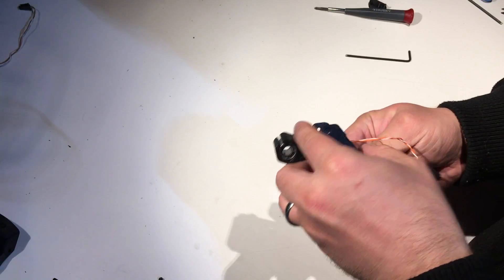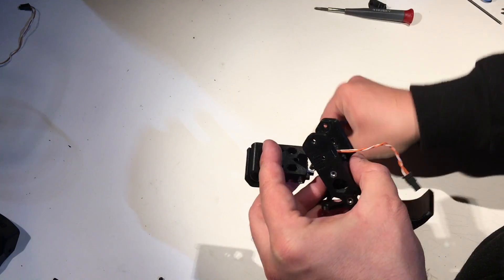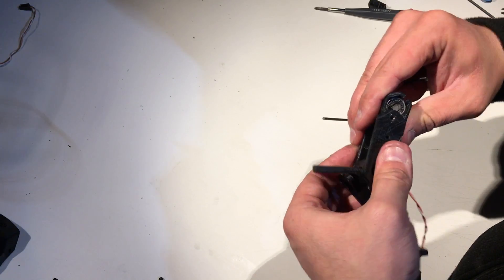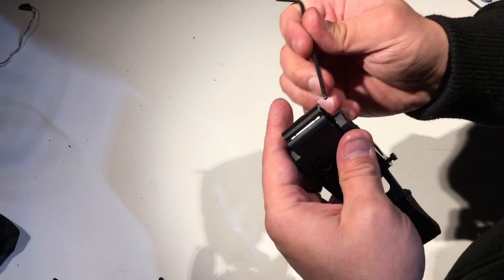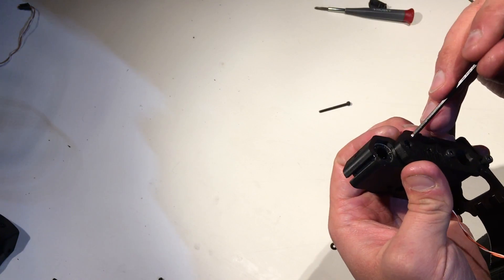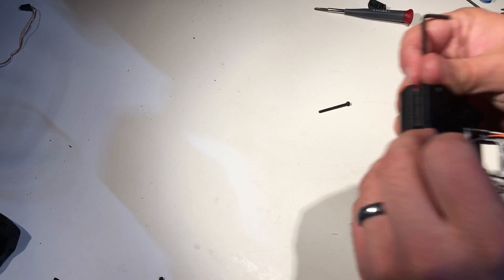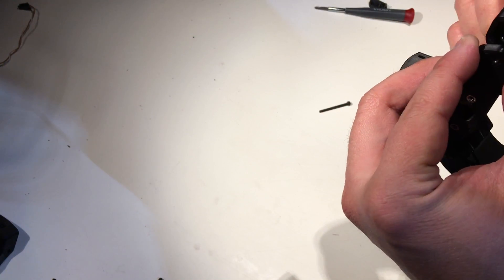The carriage has little pockets to retain these washers so they don't slide all the way in when you push them in. They are not exact because of 3D printing, but they do help. Kind of push the washer in there and line it up using the hex key. Having a ball-end hex wrench really helps here because the ball helps locate the washer a little better.